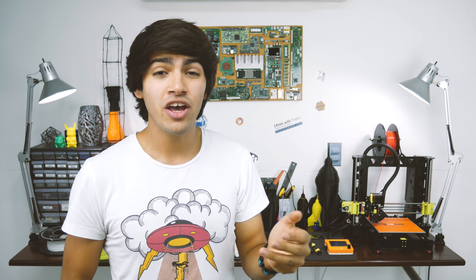If you're new in the 3D printing world, you might not know that some filaments are very abrasive. Some are so hard and rough that they act as sanding paper on the nozzle. A brass nozzle is good enough when printing the usual filaments such as PLA, ABS, or PETG, because brass is much stronger than those filaments. However, if you want to print more exotic filaments such as carbon fiber, copper, tungsten, or even glass fiber, you'll have to step up your game. The normal solution is to get a hardened steel nozzle.